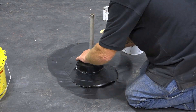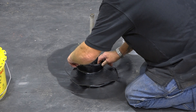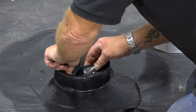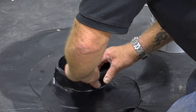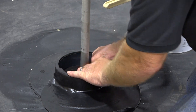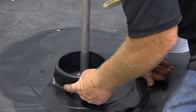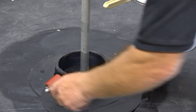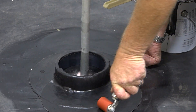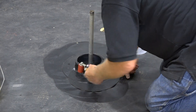Now on this inside, you're going to bring this around tight, and that's going to stretch — you just take and stretch it right straight down. There you might get a little wrinkle on that, but it isn't going to hurt anything as far as the integrity of the patch — it's got to go somewhere. So now you can just go ahead and take your roller and roll everything into place. You want to make sure you get your corner of your roller there and make sure this is all set good.